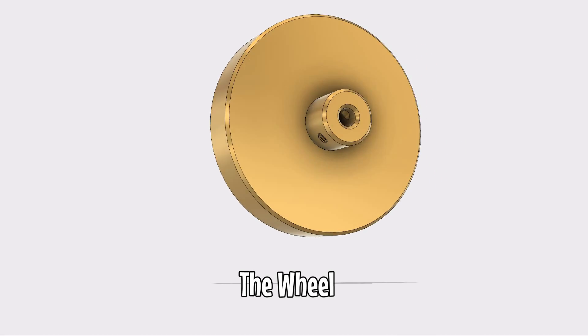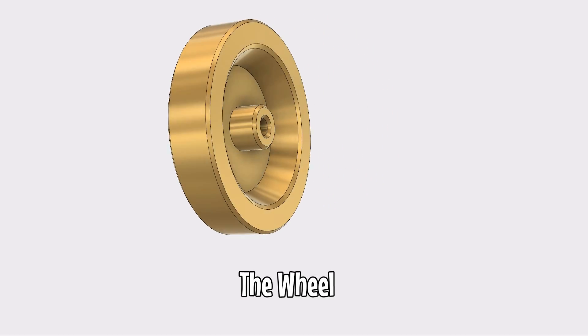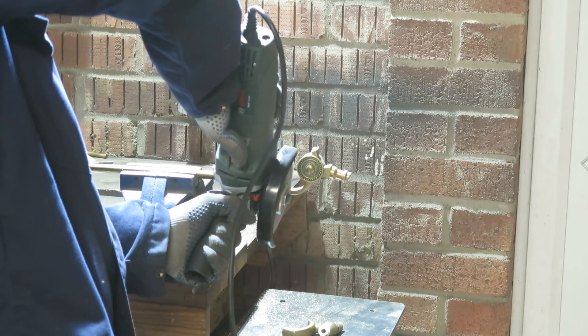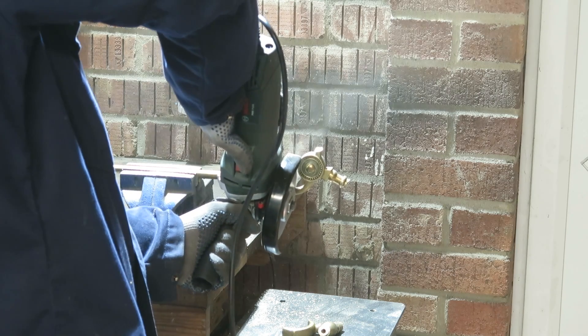To start with, I'm going to make the gyro wheel. It's made of brass and it weighs about half a kilogram. Now there's no reason I couldn't have just machined a wheel out of solid, but since I managed to get this brass poker quite cheaply, I'm going to melt it down and then cast a blank for the wheel.